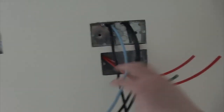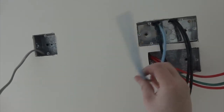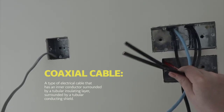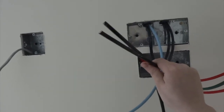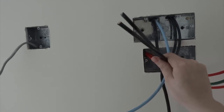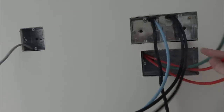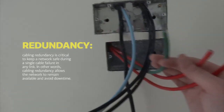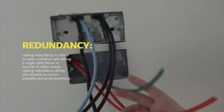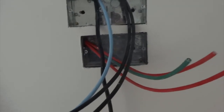And then we have our cables. We've got our CAT6A for the 4K video distribution, two coax which go through a multi-switch in the loft carrying satellite feeds as well as terrestrial TV, two data cables for smart TV, that sort of thing, and a green CAT6 for redundancy — or in the future if you wanted to do an audio return or something like that, you could then pump the audio over the speakers in the room.